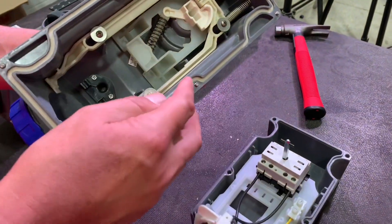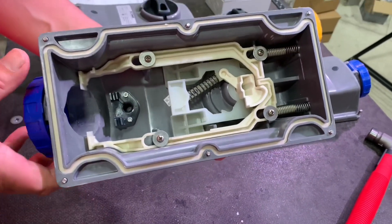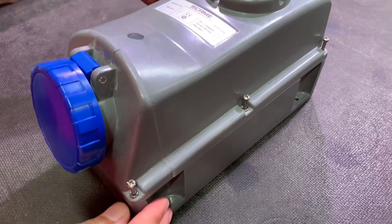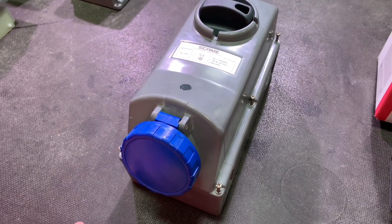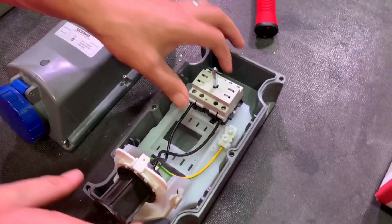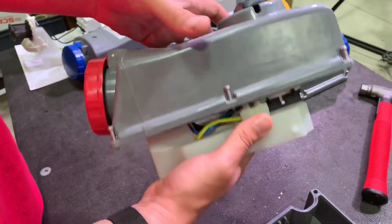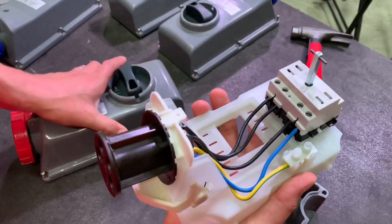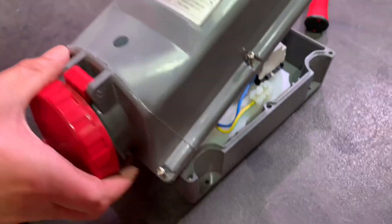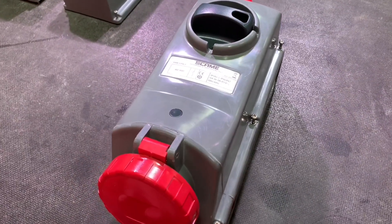You just push that in there, wire it, and then bring in the front part of the assembly which has the interlock mechanism between the isolator and the socket — making sure you can only energise it when there's a plug inserted. That just slots onto the front. Once slotted into position, you could change your mind — say you didn't want a 230 volt socket, whether it be you or the customer that wants a change. Factories change, processes change. You can take this front assembly off; the housing stays secured to the wall and you bring in a new one. Here's a three-phase 400 volt socket outlet — attach the inner housing with the three phases and neutral, drop it in, and bring the front housing in. The process is now changed to 400 volts, and the back plate stays in place.